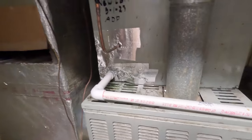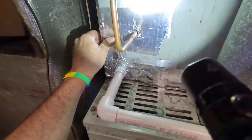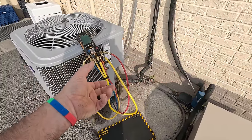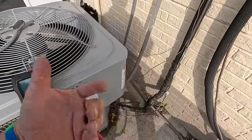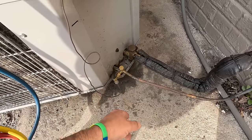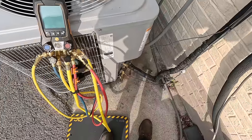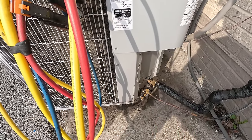How long has it not been working? We're probably going to have to take this cover off and get into the coil. I'm about bet it's low — I've seen oil out there on the outside. The other thing I've seen, as usual, is people think 'my air conditioner doesn't work, so I'll turn it down to 50-something.' Anybody in the field knows all that does is make it run longer — it doesn't come out colder. That is a crap ton of oil there. Is that because we were leaking at one time? There's water in the bottom, which it rained last night. Let's go ahead and put the gauges on — chances are it might be frozen up. We're flashing. It's between frozen up and low on charge.